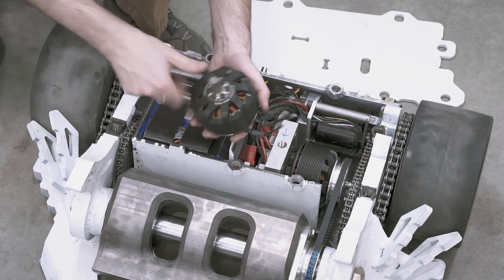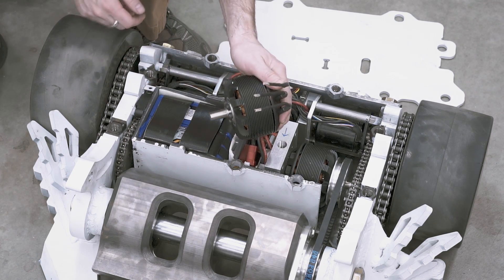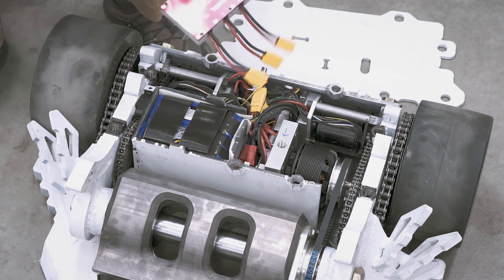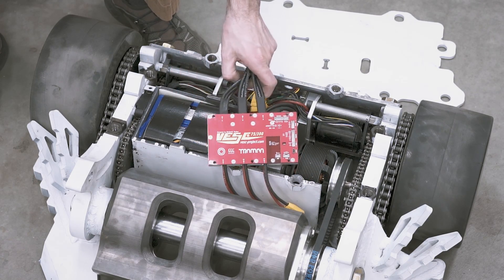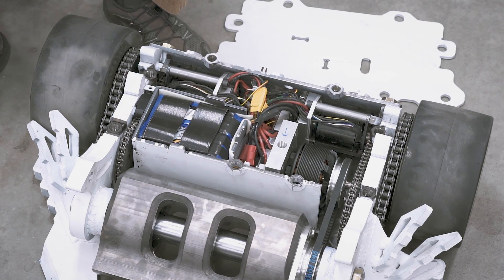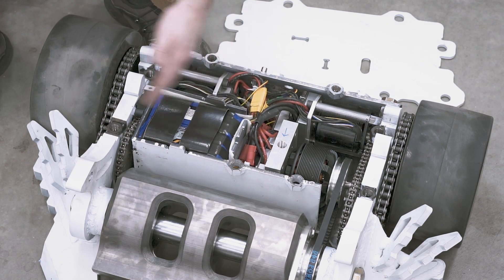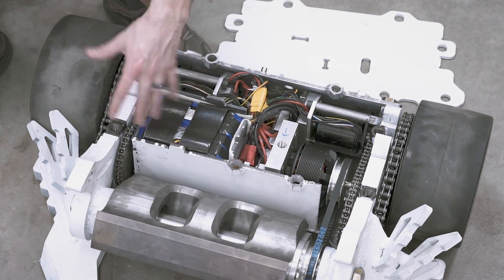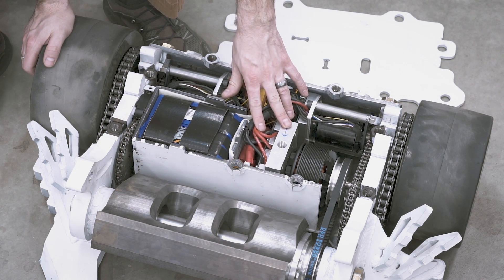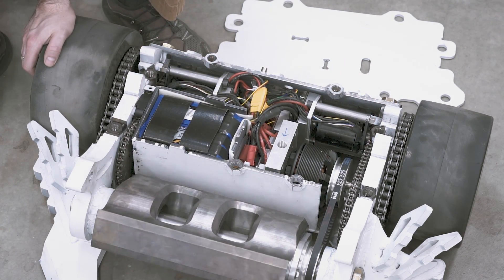For the weapon, we're using an 8038 motor sitting down in here with a pulley. We are doing a one-to-one drive on that and using a VESC 75-300 ESC. We are running sensorless on the weapon and so far it has worked out pretty good. We still need to do a little bit more tuning — that's what we're going to spend the whole weekend on, getting this drum tuned. Everything looks okay for right now, just need to dial it in a bit. The motor is pretty much just bolted on, with a one-to-one pulley driving the drum.